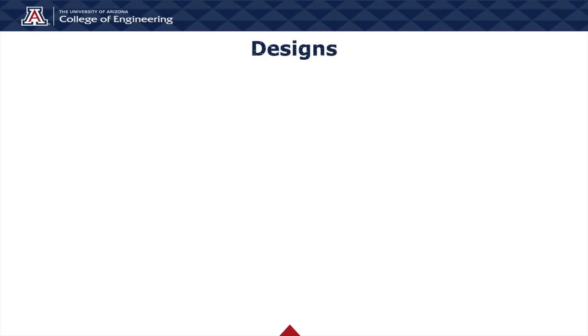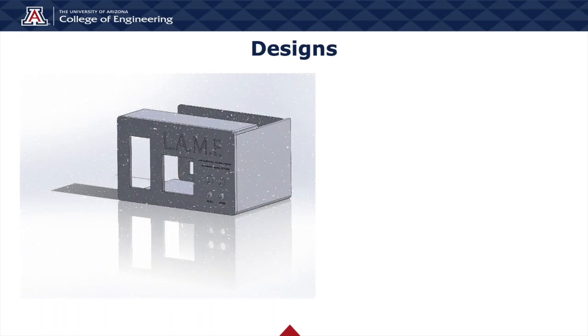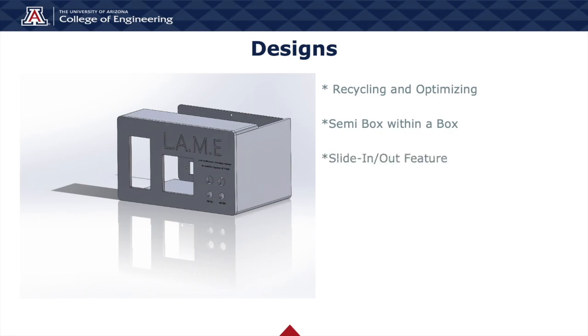It is often difficult to make changes to the wiring or even open most electrical boxes due to the risk of pulling or damaging wires. We wanted to avoid this by making an open concept box within a box. This inside 3D printed box slides into the larger aluminum box completely so that no wires are pulled, stretched, or damaged. This also serves as an insulation barrier between the electronic components and the metallic box.